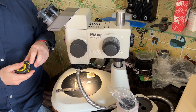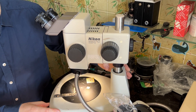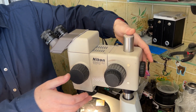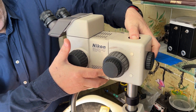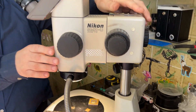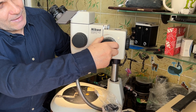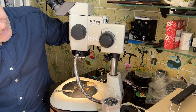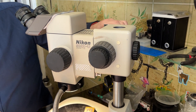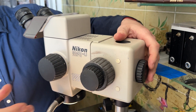Here, if we have no need to make notebook boards, only mobile boards, this is a very pretty stand. Let's check how it works. This stand has a pretty high range of moving up and down. We have a base ring here that lets the microscope stand set in one position and make rotations. The focuser alone for the Nikon SMZ-U has five centimeters of travel from upper to lower position.